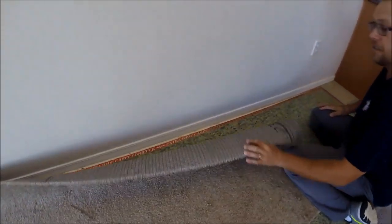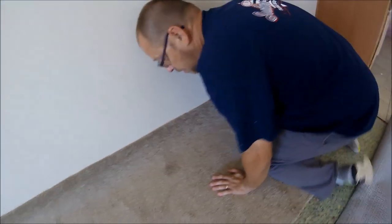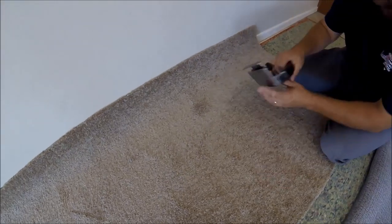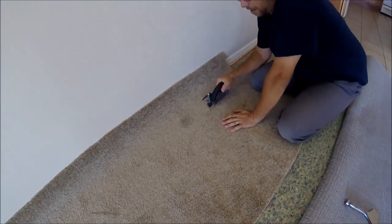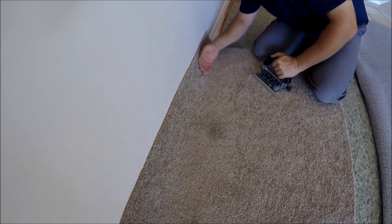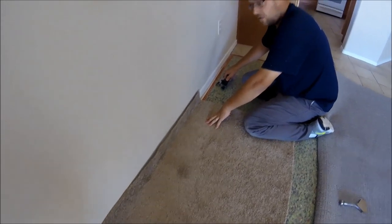As you can see, the carpet is just laid up against the wall. There's a lot of different factors to take into play whenever you're using a carpet trimmer. The tack strip is a little far here. The pad was already down — we're just going over existing pad and carpet. Rule of thumb: if I got my carpet flat on the floor like that, this trimmer actually has different plates in it right there — you can take those plates out and make it lower or higher depending on the thickness of carpet. I just got used to using the trimmer, and I'll lean it up that way to make it go short, and I'll lean it up this way to make it go long. With it curved up like that, you always want to make sure you get your carpet mashed down in there. Always want to make sure it's in there real good like that — it's going to be just right for your cut.